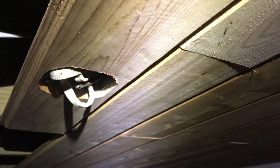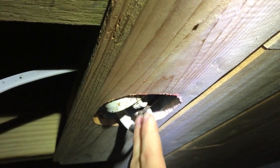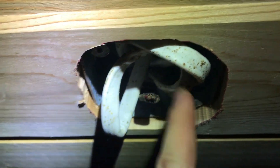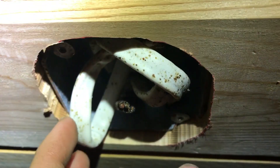What I want to show you tonight is this electrical fixture, because I thought about the starter and finisher strip reveal issue but did not think about these receptacles. Because of the shift I did, it put the receptacle right in the middle of the board. It would have been a lot easier if the electrical box had landed on the seam so I could have just done open-face cuts. Instead, I had to grab a 32-inch board to span either side, held it up, eyeballed it, and cut a hole with a 2-to-2.5-inch hole saw where I figured the middle of the box would be.